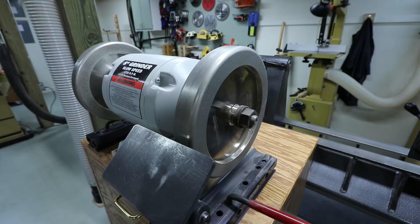I recently upgraded this grinder with CBN wheels — I bought the ones with abrasive on the sides. That feature works perfectly for sharpening skews. Don't try that technique with standard sharpening stones, as applying lateral force to a stone can cause it to fracture.